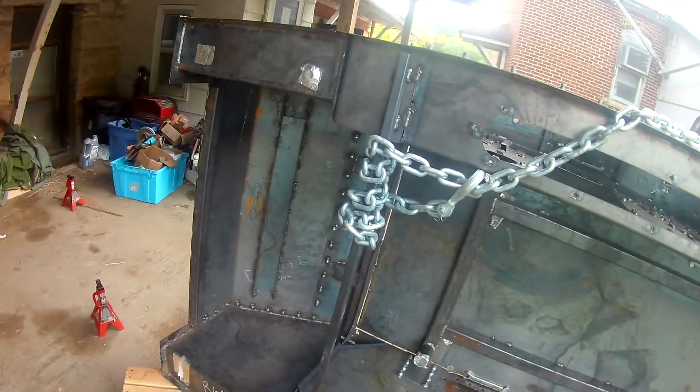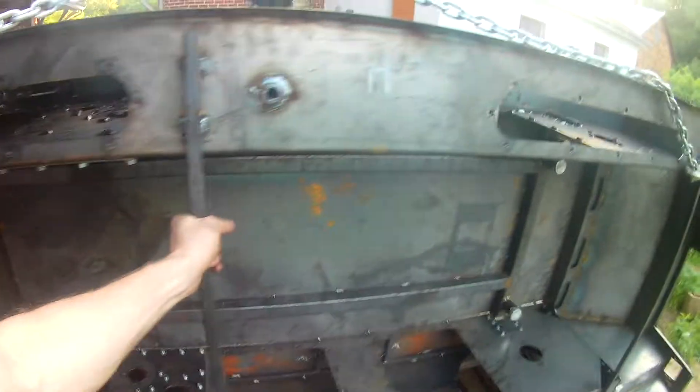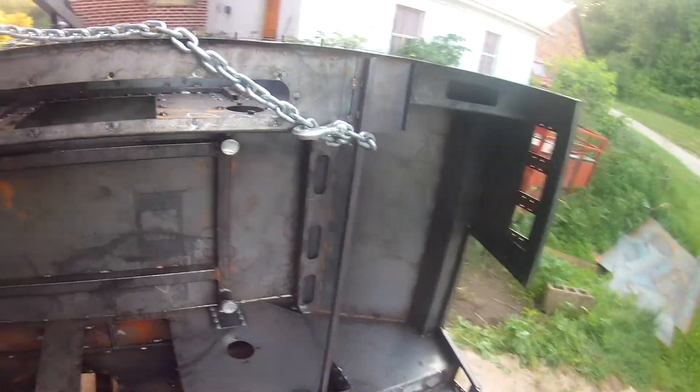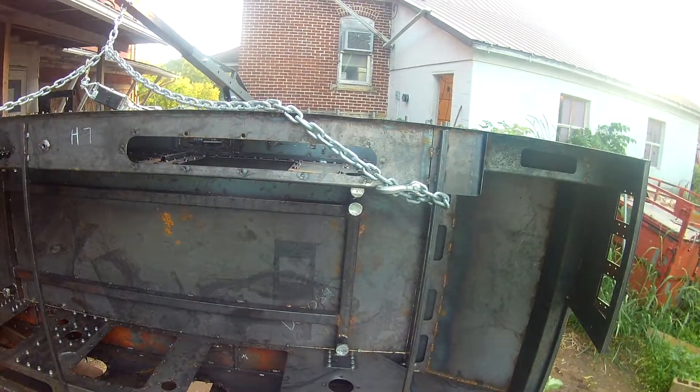Of course I just removed some of them because I didn't need them in the first place, so in the future I'm going to have to do some through bolts to make it work better — it's a learning experience. Got some tack bars running across just to give it some more stiffness as I roll it around for better welding positions. From a tolerance standpoint, it actually came out pretty square in just the bolted condition.